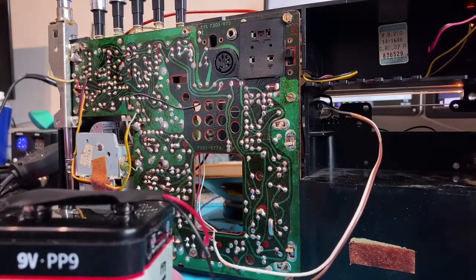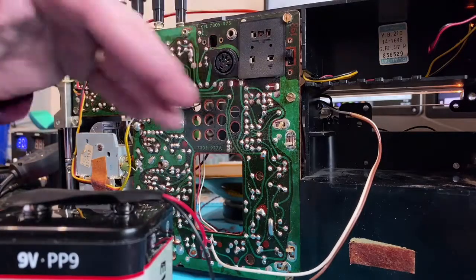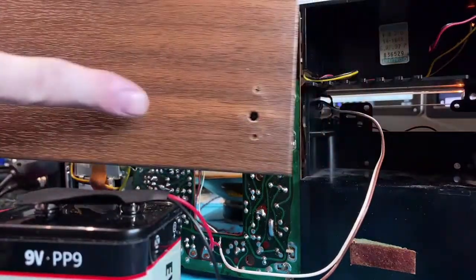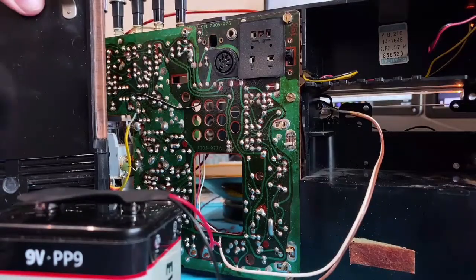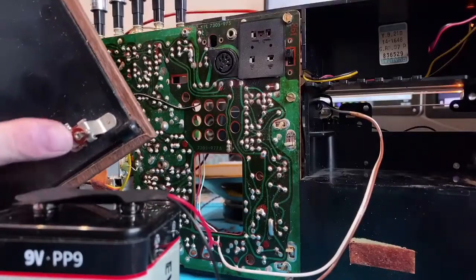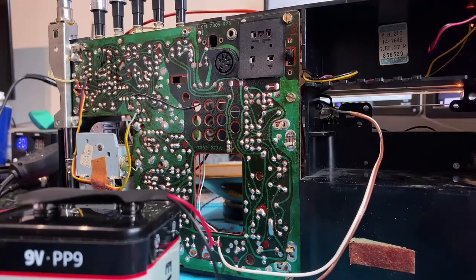So what I've done at the moment is where the mains will go, well, the external power, because the mains adapter isn't fitted. So there was this external socket fitted here. It's one of those dual pin, concentric pin things that you can never work out which is positive and which is negative. But I'll wire that up to here eventually, and then you can put an external 9-volt supply in.